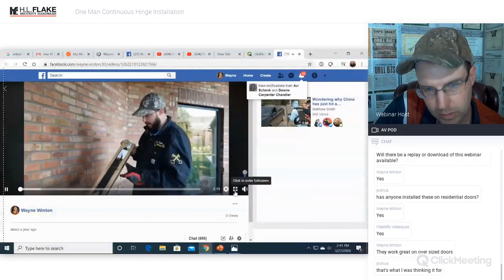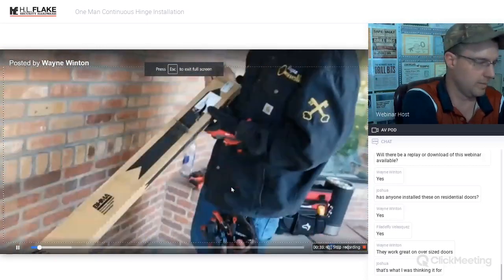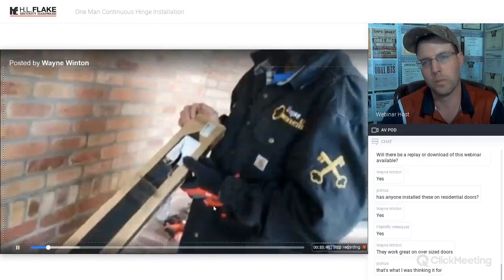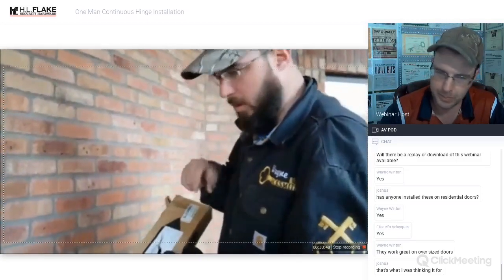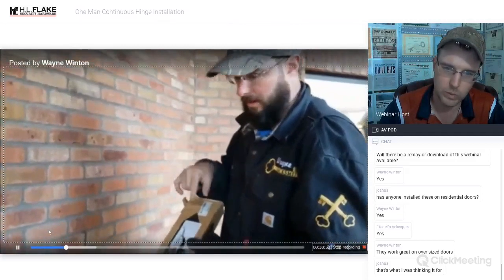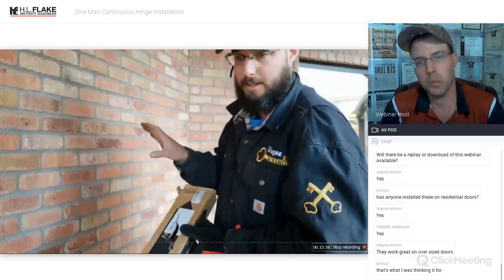This is Wayne here with Tri-County Locksmith Service, and today we're going to be doing a Select Hinge continuous hinge. I'm going to show you how to do this without ever having to pull the door. You can make this a one-man job. You're not going to have to pull the door, but we'll go over the basics first. Last time we tried to do this, they sent the wrong hinge. It was a supplier issue.